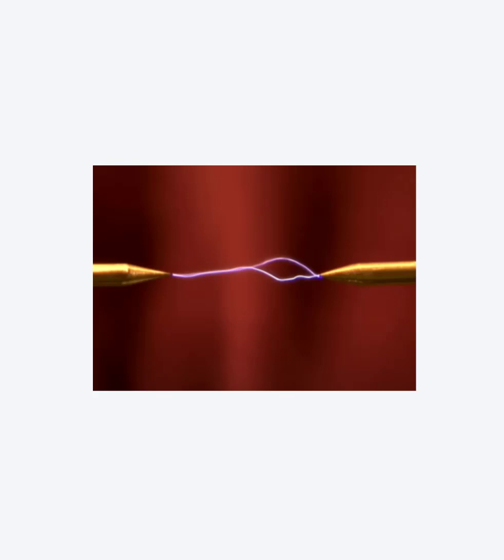This coil has been deliberately designed to produce sparks, but the coils in any electric motor are quite capable of producing sparks too. In our case, the trouble is that the high voltage can drive current back into the Arduino and either cause it to reset or physically damage it.